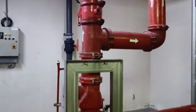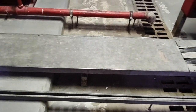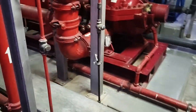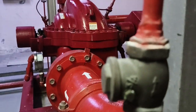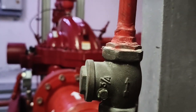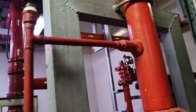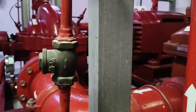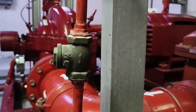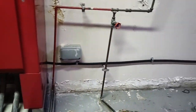The sensor line is connected from the system directly to the controller. Every sensing line has to have a check valve in the opposite direction. Here they have put the sensing line inside conduit using half-inch copper tubing. You can see the direction — instead of going downwards it is going upwards. Somebody might ask: how does water flow from the system into the sensing line if it is in the opposite direction? Anyone who knows the answer, please comment below.